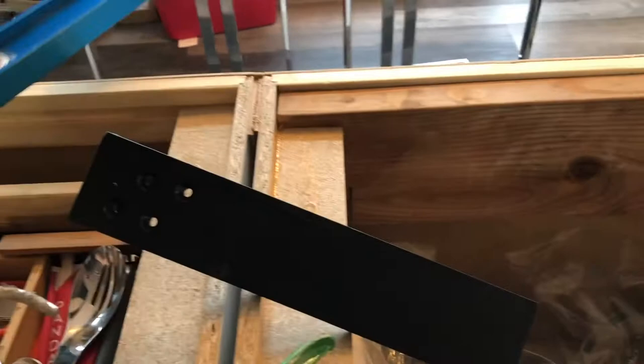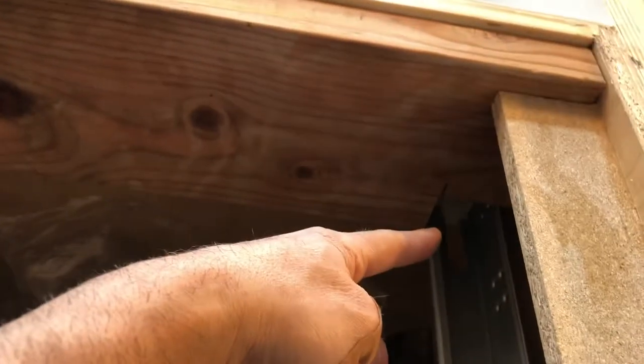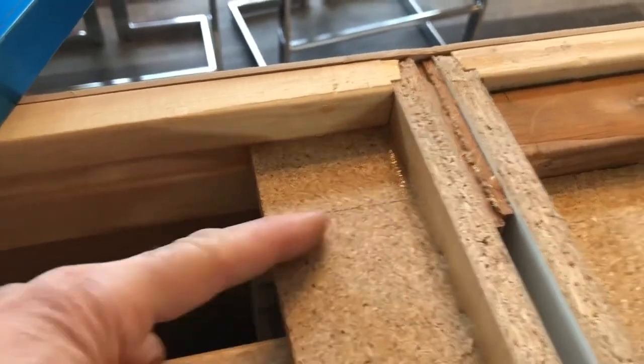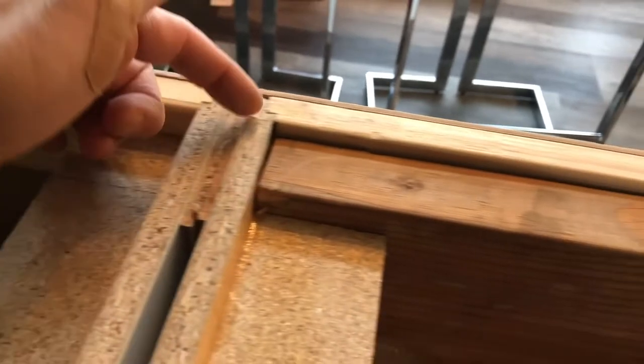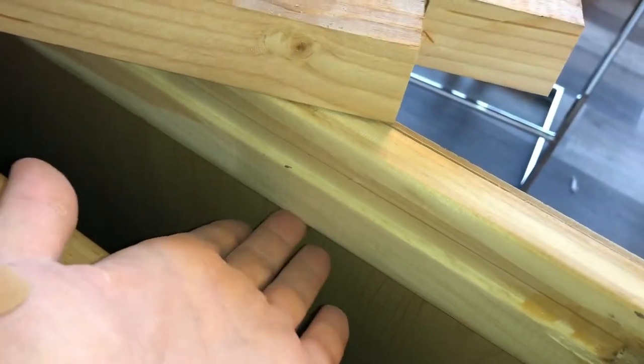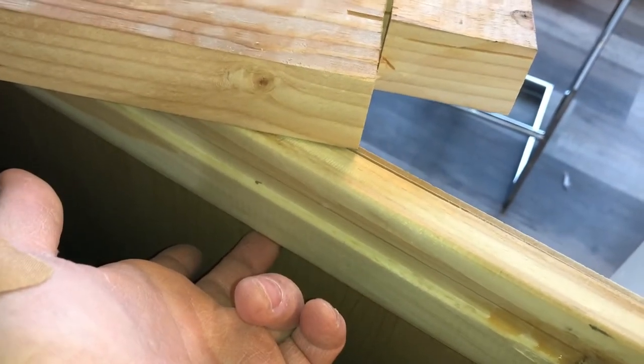I'm going to show you how to gouge this out — that's going to be your main question. What I did over here was gouged out this corner and this corner, and I had to cut this piece out. I lined up the two-by-six, marked it, and that's where it gets cut. I've got a little bump right here so I'm going to have to gouge this out — about a quarter inch — so it can be snug. See how it goes in like that? There's a space right there, so I'm going to gouge it out so everything is snug and tight.